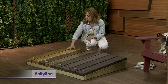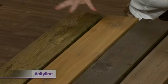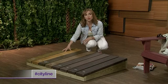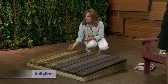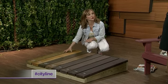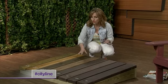So when you start with pretty good new wood, you really just want to protect it, put some sunscreen on it basically. On pressure treated here and on cedar here, we have Benjamin Moore's Arbor Coat in a transparent finish. It just has a little bit of pigment, and it really just protects. So you have to put the protective coating on top of that. And again, it keeps it waterproof, UV protected, all that.